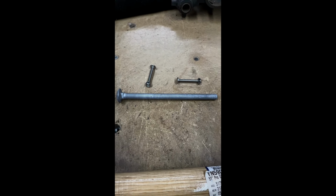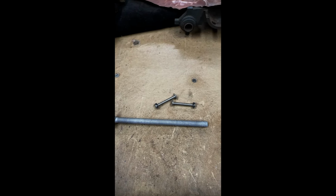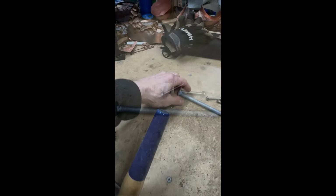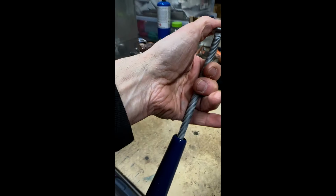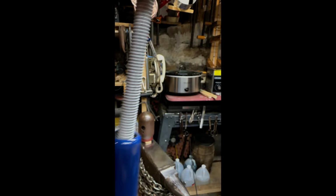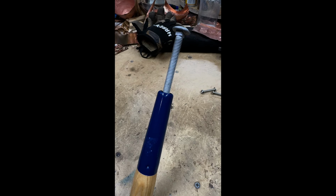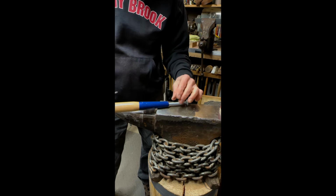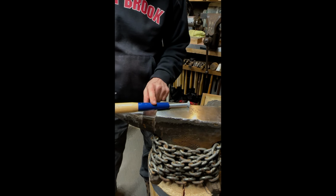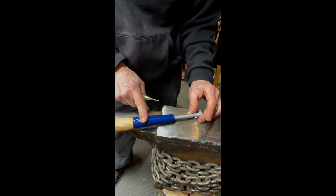So all the stuff I bought so far, this piece of wood with the ferrule, the bolt that I'm going to use for the point and for the fastening equipment, comes to about 17 bucks. All right. The beauty of this is that it is pre-drilled, so you can take the bolt, insert it into the hole, and with a little bit of finagling, it goes right down into the ferrule. So I've inserted the bolt into the wooden pole, and the ferrule is already attached to the pole, so it doesn't come off. So I'm going to drill two holes so I can put those stainless screws through here to firmly attach the bolt into the pike handle.